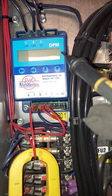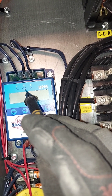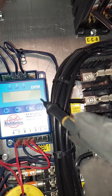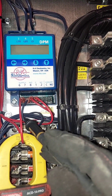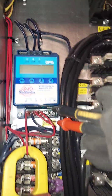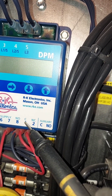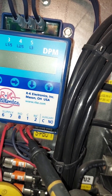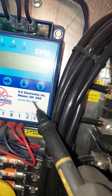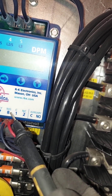Now you can see the power phase monitor up top — this is where it's monitoring the three-phase power, lines one, two, three. Right now we're missing one line, and apparently the line that's missing is part of what's feeding power here — that's why this display is blank. Here are the contacts — this is the switch. I've got normally open and common. Two wires connected: one in normally open, one in common.